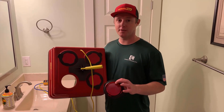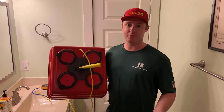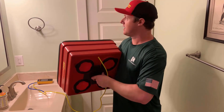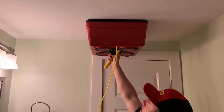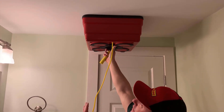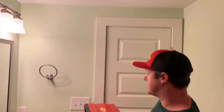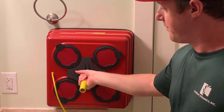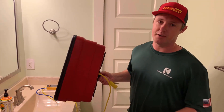I mentioned before that this is two tools in one. If I have the holes plugged, now it's a pressure pan. So if I have my blower door running to depressurize the house at 50 Pascals, I can look at vents like this and try to locate duct leakage to see if that vent is leakier than others. I can also look for other penetrations in a wall, such as a switch box, with my blower door running. So with this, you get more bang for your buck because it's two tools in one.